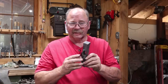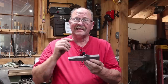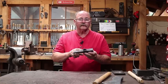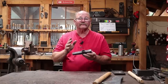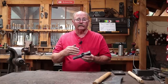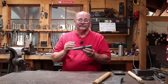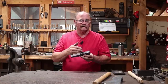Plus, I doubt this is going to be an everyday user for me. It's an exercise in making Viking-era tools and even if it never strikes iron, it's still a learning process. So I'm going to light the coal forge again, bring this up to a welding heat, and we're going to try and fix those two issues. Whatever we end up with, that's where I'm going to go with it. But then I'll need to let it normalize again before we go to the hardening and tempering stage. I'm pretty sure there's not going to be time today to completely finish it and try it out, but we're going to get it as close as we can.